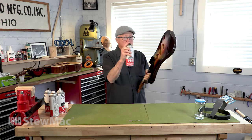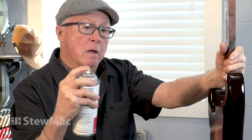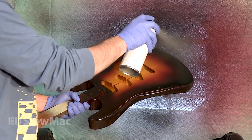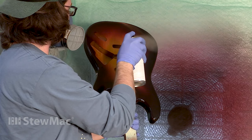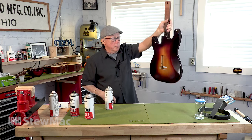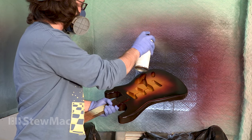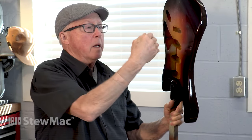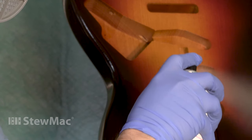When you're spraying, don't spray too close and don't spray too far away — probably somewhere in the middle range. Come closer if you feel you need it, but it lays out far more paint than you realize. Once you find that sweet spot, keep it consistent. As you move and twist the guitar to cover the sides and rims, you're also moving the spray can. I don't like to spray with the guitar hanging because gravity is going to make the lacquer run downhill. I like to hold it as close to level as possible, and I hit it at an oblique angle so the spray lays gently over the piece.